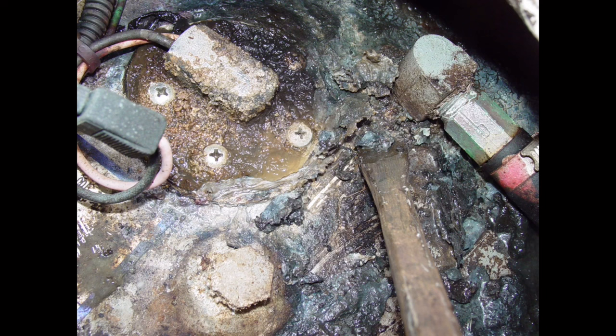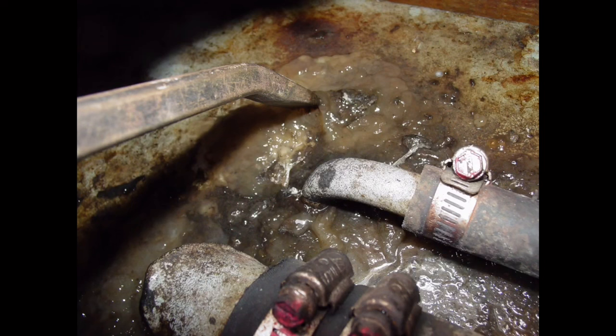Corrosion issues can also arise when the aluminum tank is foamed into place during boat construction. The foam often retains moisture, which then rests against the tank, promoting corrosion.